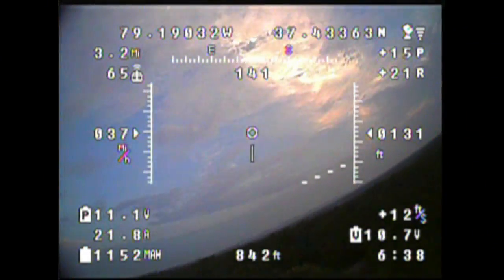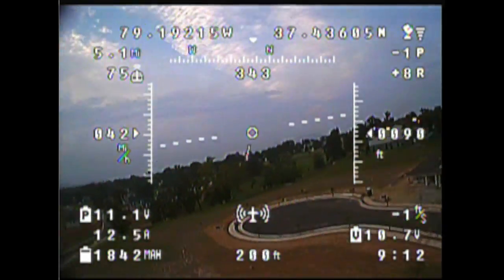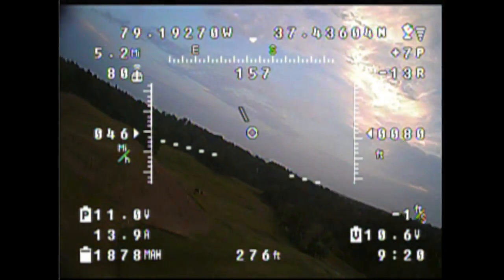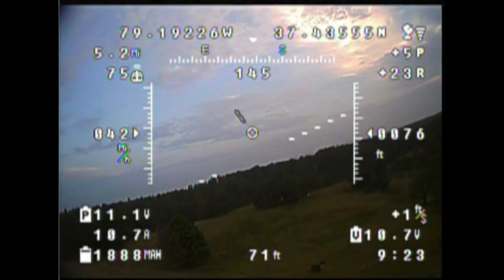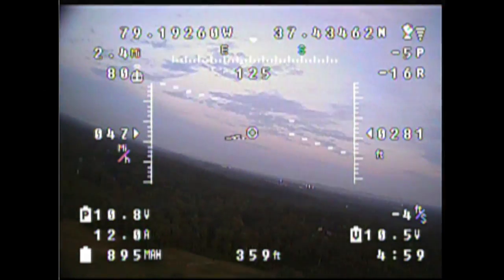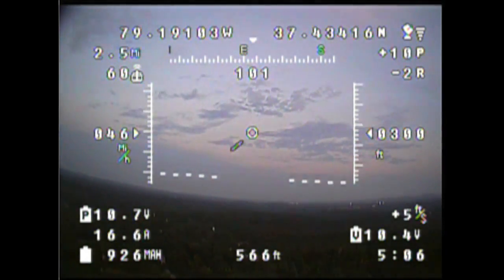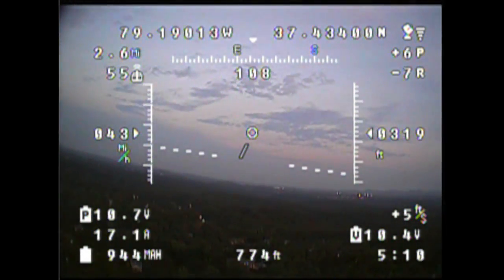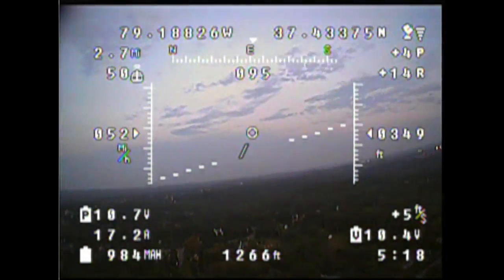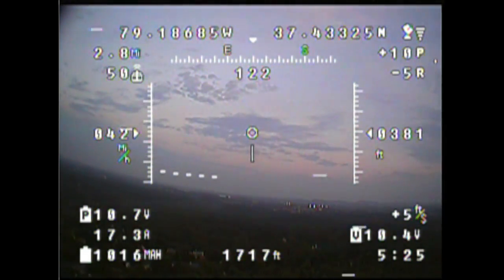I'm going to do a little narration here over the flight video. Not only was I testing the video system on this flight, but I was also doing some tests on my return-to-home system — just some failsafe testing. On this system, much like any other 1280 system, all the installation was done and everything set up properly. It's always good to do a nice line-of-sight flight. I usually set up my monitor screen rather than going goggles, do some initial tests to make sure everything is operating fine, and fly about as far as I can see it and bring it back. It's also good to do a general burn-in on the video transmitters — let them stay on and make sure everything is operating properly once everything reaches temperature.